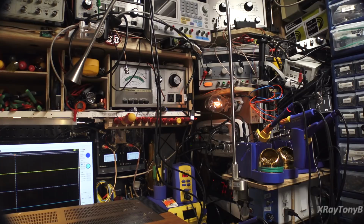And there, the protect circuit just kicked, and now it kicked back out again. So you can see the idle current of this receiver is so high that the dim bulb tester will actually cause the protect relay to kick out. And that bulb will never go dim just because there's so much idle current. Now let me show you how much idle current this thing has.